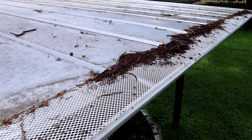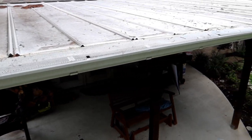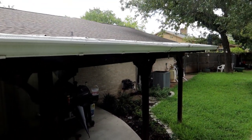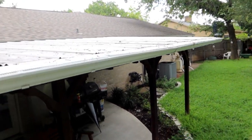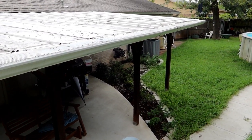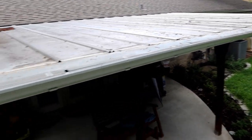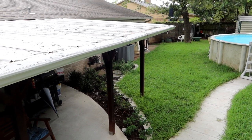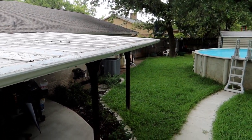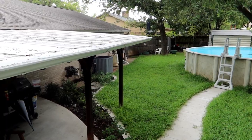But I want to get up here with a garden hose and see if I can reproduce what's going on. Now, before I run the hose through there, I made the decision to try and get the leaf waste off of there. I don't think that's a huge factor in this. The more I look at this, the more it seems clear that the gutter sags a little bit, and what we may be dealing with is more water going through here when it rains really hard than the system is designed to handle. It's going down here as fast as it can, and since that's the low spot and there isn't enough volume going through here, maybe it's also just overflowing here. So we may ultimately get back to the idea of putting another downspout over there and going into the grass with that. That may be what it comes down to, but we're going to play around with it and see if we can figure it out.